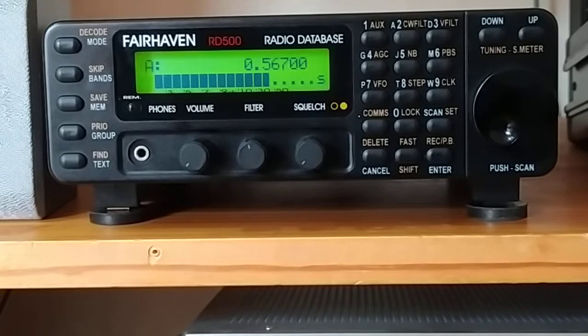There's a choice of bandwidth for most modes. There's a CW filter with a stereo CW facility — I think it used to be called binaural or something strange like that. For the CW buffs, there are quite a few settings. There's a noise blanker, a tuning meter which is a center-zero meter besides a normal S meter. It has a notch and peak filter, both variable. AGC with settings for all the different modes.